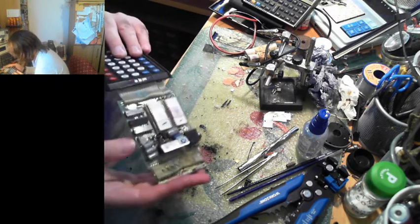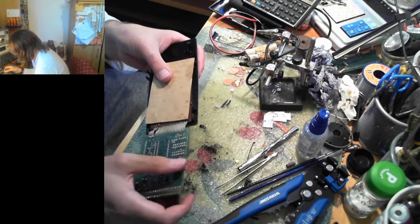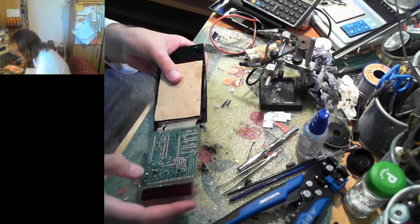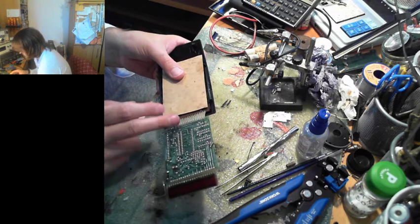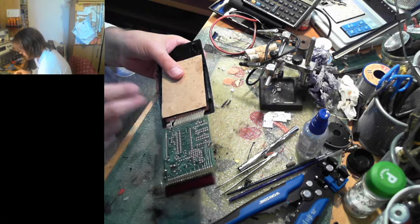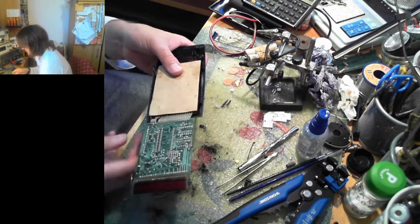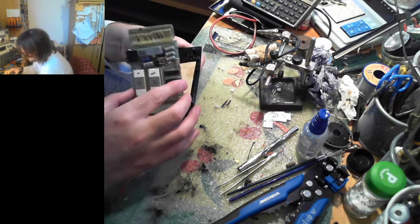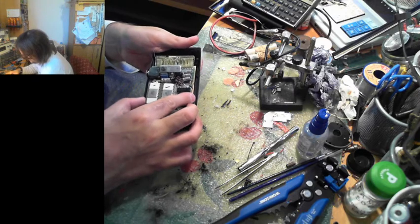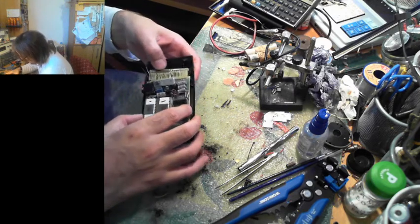So look at that proper bodge. Resistor wire goes round. I wonder if that's a factory bodge straight onto that trace. Nice thing is we've got some data there. VSS, VDD, VSS, VBB. Ooh, these are some terms you don't see much these days, because these old chips generally like to use like a bazillion different weird voltages, which makes them a real pain in the arse to run.